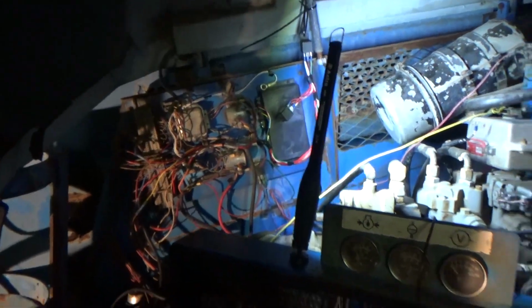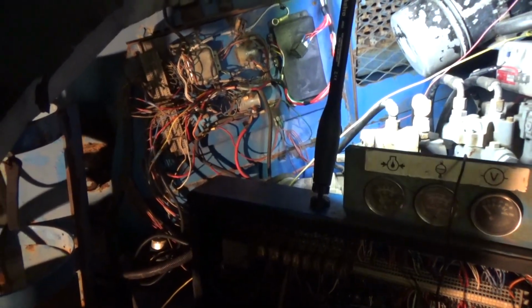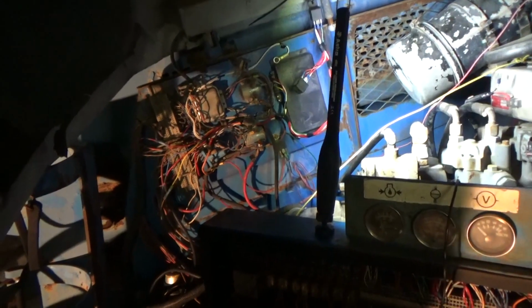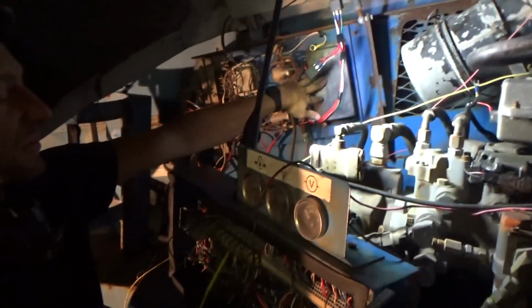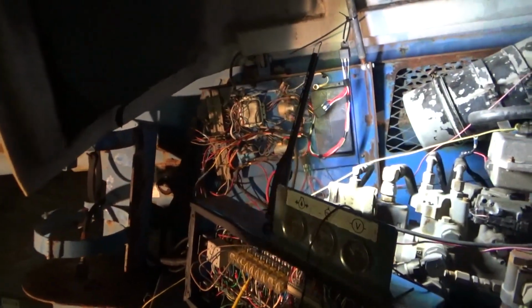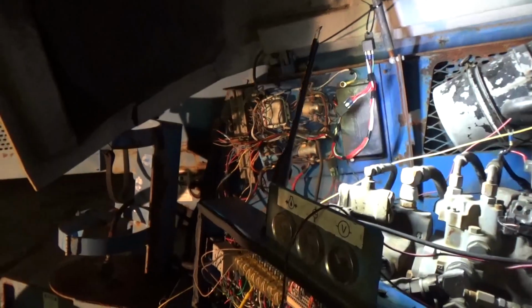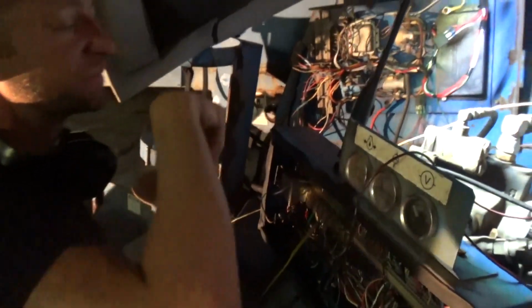True. Does it have any other power output? What do you mean, power output? I mean this servo. And anything else, or only this servo connected to this box? Yeah. Why is it 15 amp? Well, I mean, they always go higher than the actual load. You know, for your power windows, you have a 20 amp fuse for like a 10 amp load. But if this is the one output source, then it is capable of 15 amp.